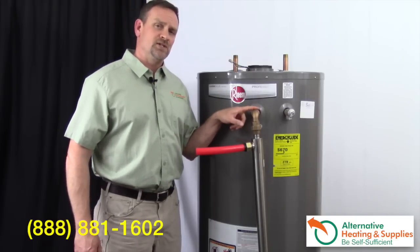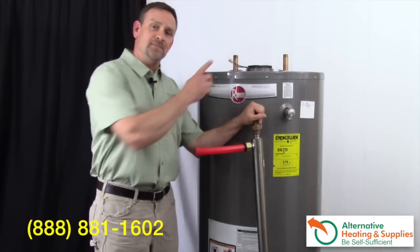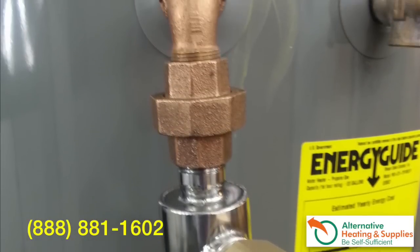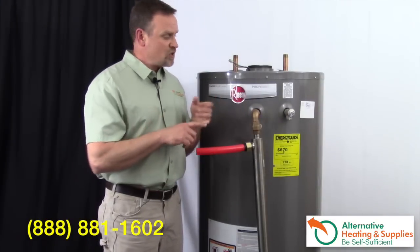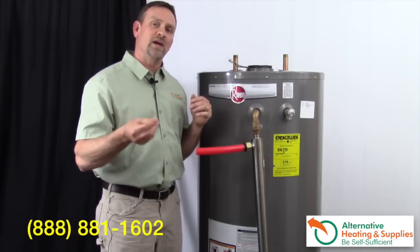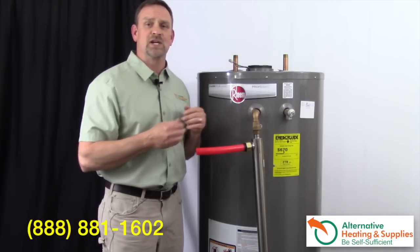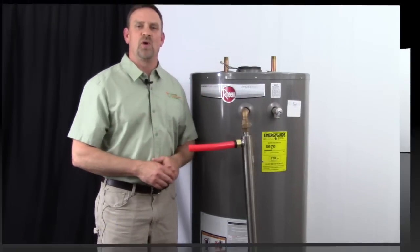When doing this, remember that the tank is under a lot of pressure. Especially on the domestic hot water side, I recommend that you use unions, so if there's ever a leak or any adjustment needed, you can take it on and off pretty simply. Also make sure you're using Teflon and a domestic hot water rated Teflon and dope, because you don't want dope that's not safe ending up in your drinking water or bathing water. Make sure everything used is rated for potable water.